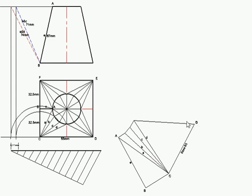And I need then to find the length of this line, which would be the same as this one, seeing that the circle is right in the middle. All these lines that we have here will have the same length as A, B, C, and D. So that line has got the same length as D, which is 74. So I put my compass on that point, 74 millimeter arc, that gives me D and that gives me this base.